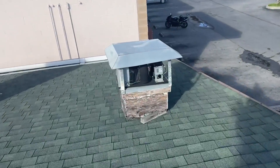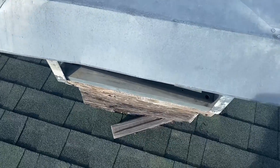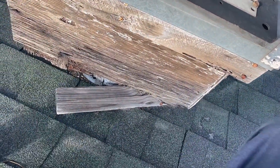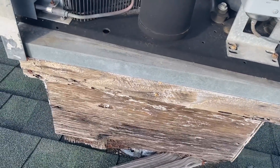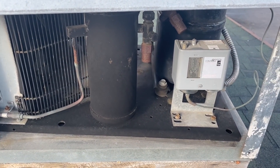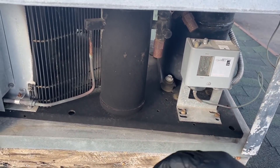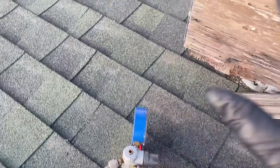This little shitburger here is not running. I'm going to pull this cover off. I was just up here — the solenoid's calling and the pressure switch isn't making, so I'm thinking it's low on charge. We'll get gauged up and take a look.